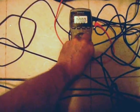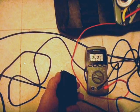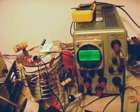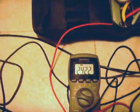Now to check the power, I need to move a couple of connections. I take this out and put in these here — this is a real low-budget way of doing it. I key the mic and there is 242, 243 volts dead key. We can see it on the scope over here too. That's what it looks like. That's peak DC, by the way, with a rectifier and a capacitor.